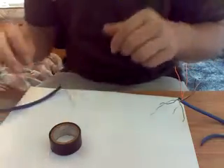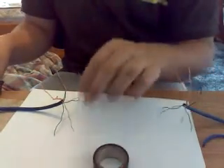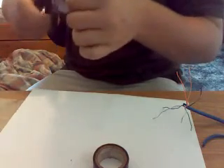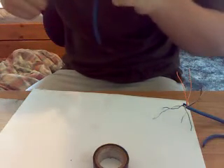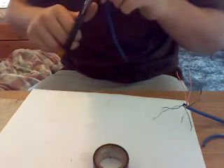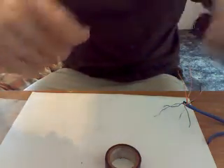Now that the wires are stripped and separated — I forgot to tell you what you're going to need for this: electrical tape. Don't use duct tape, especially for an outdoor run — it's just not a very good idea. And here's the hard part: stripping these little wires. Apply just a little bit of pressure to the wire, just enough to get that little bit of jacket cut, then get your fingernail down in there and pull the wire and the jacket off of it.